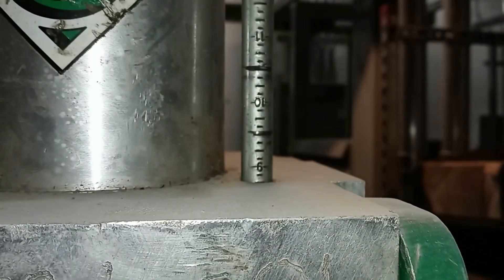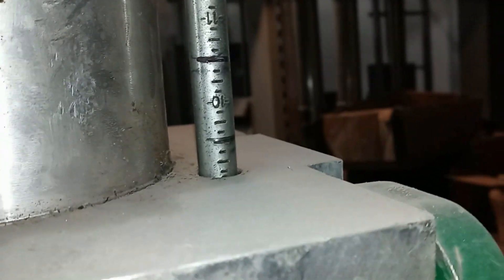I'm gonna do a 90-degree bend and I'm gonna use the ruler. Basically, I measure it to the bottom of this piston — you can measure it to the top, but I do it to the bottom. You can do it to the top too, and we would have to take it to nine and three-eighths for a perfect nine, or I use this one down here for six and seven-eighths.